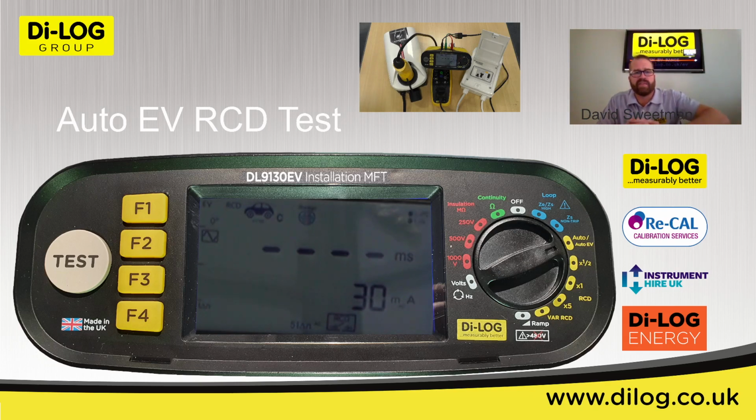This sequence will run 6 milliamps DC, then it will do the 0, 1 and 5 times on the AC side of a Type A RCD. At the end of the sequence, when it's completed, you'll have the option to do a ramp test. This is an optional test. The sequence will finish in a couple of moments when this EV charger resets. You might be wondering how I'm doing that sitting here as well, but there's a video recorded earlier that you can see on the screen that will show the sequence being tested.